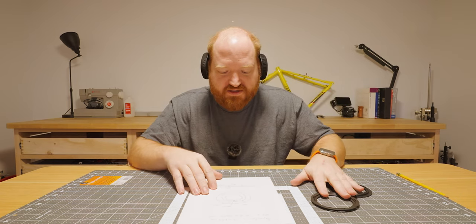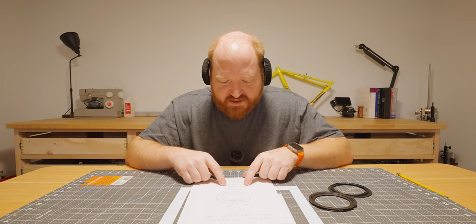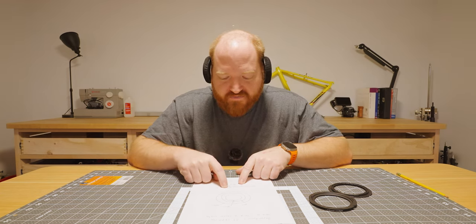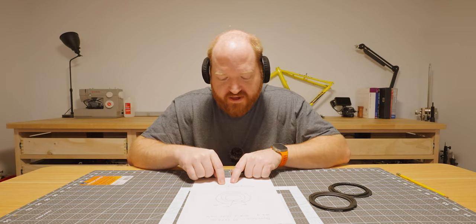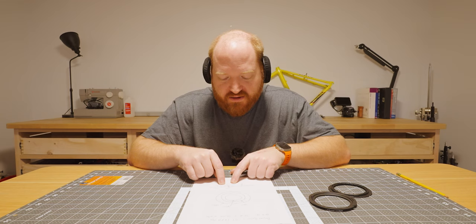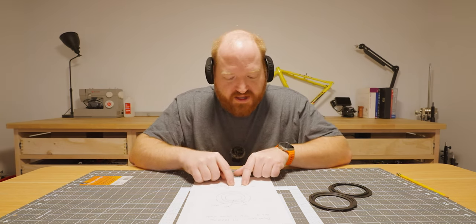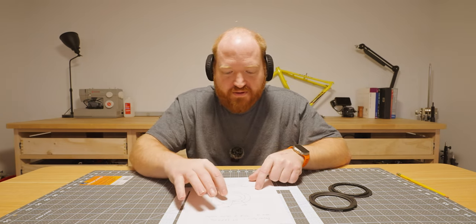His doodle says that the TMA-2 mounting system has four pegs that stick out that are 4 millimeters in diameter, that have a 5 millimeter ball on them. The entire length is about 8 millimeters. The thickness of the plastic is 2 millimeters. He also gives me a couple of diameters.